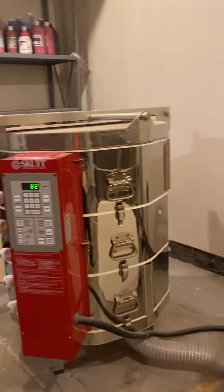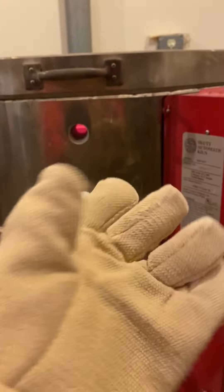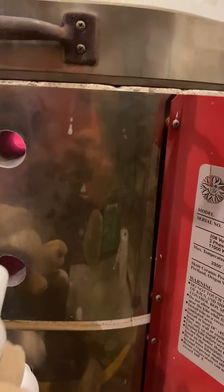Right now, kiln left, I've got kiln right and kiln left. Right now it's at 1290 degrees. I've removed one of these pegs — I've got my big old gloves. You can remove some of these pegs, that helps vent. Can you see the color that's inside of there? It is like red hot. I'm going to put these pegs back in. I would definitely never touch this handle here. The top is like piping hot. I'm going to grab the other peg right here and put it back in there.